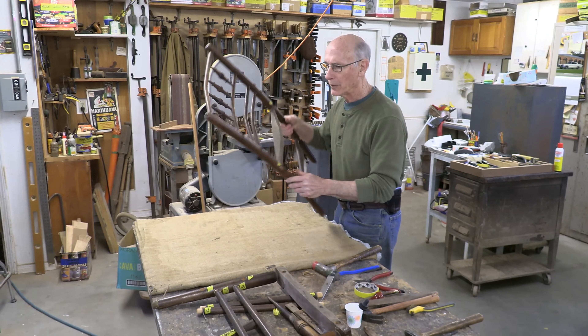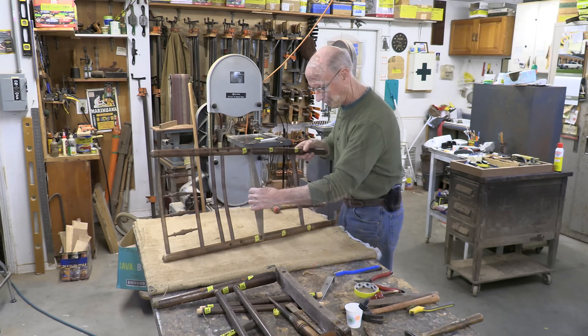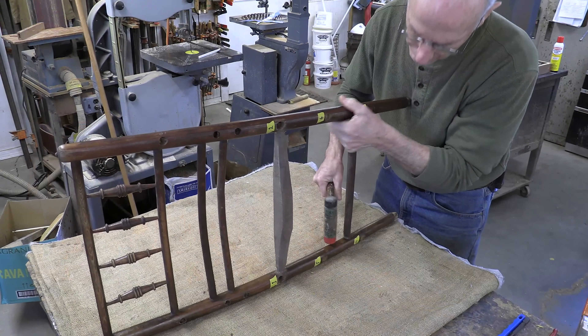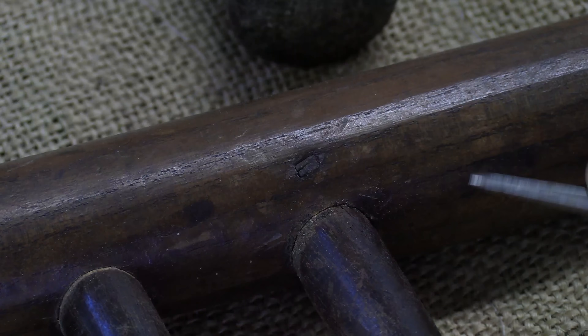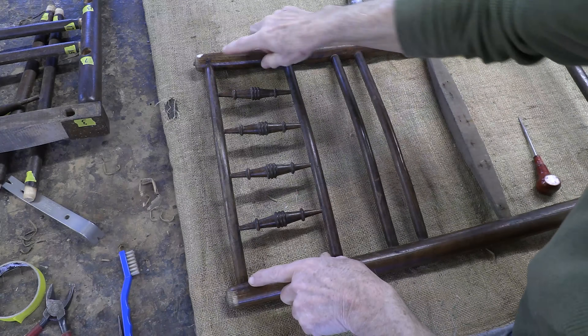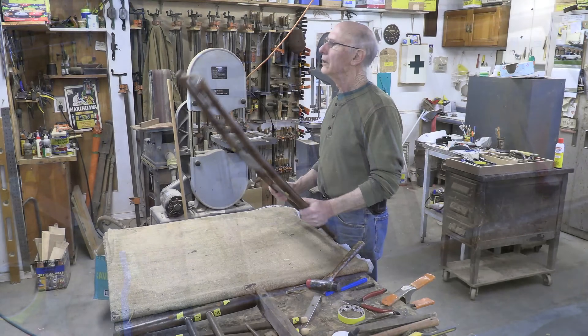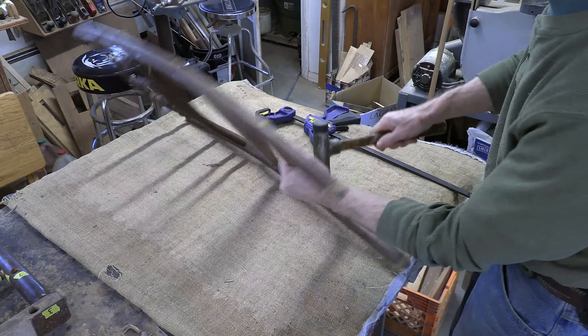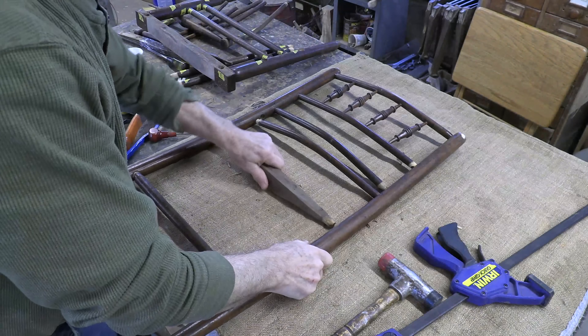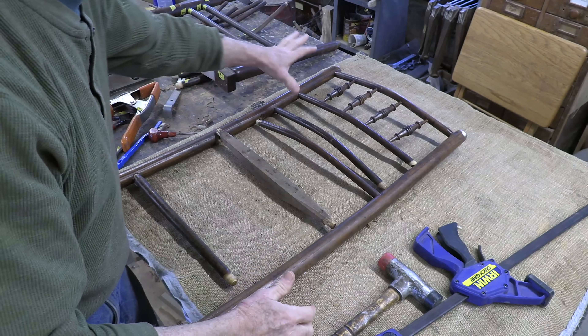I'm going to re-glue this back, but note that I'm not going to mark these joints — it could be a mistake — but I'm just going to take this apart right here, keep everything in order, put it back together again. Everything is loose, but a quick check: I can see there are four random nails here and the crest rail has two, one each. Although this has looseness, I'm not going to take it apart because of those nails. What I will do is try to spread these joints and inject a little hide glue in each one. Everything kind of just popped apart, except where the nails are, so that's good.